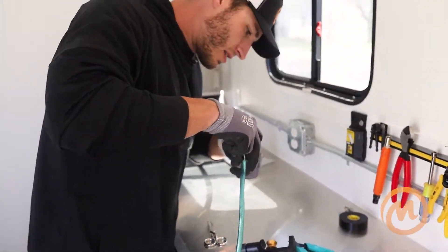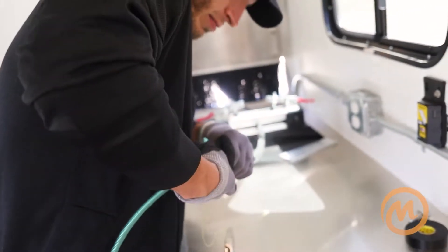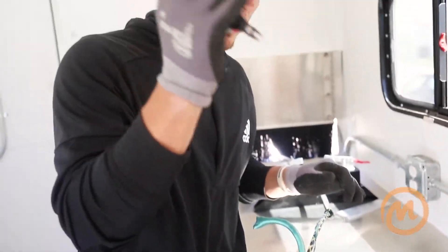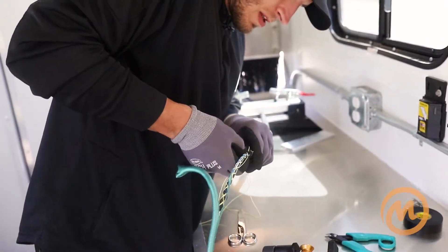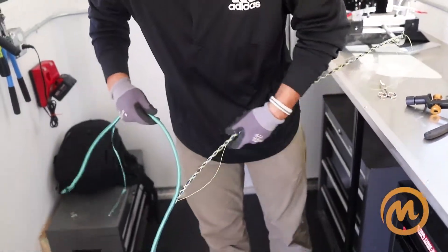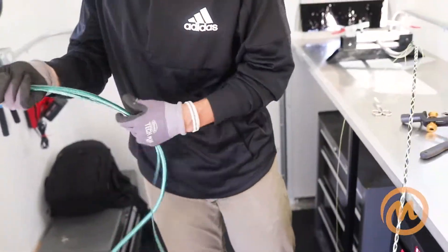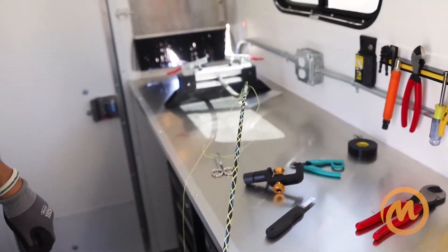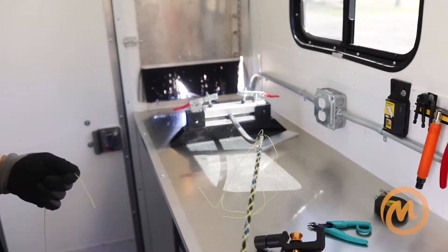Come to the base and pry up the armor just a little. That one kind of broke, so that's good, but it's always good to have flush cuts with you — give it a little snip. Just pull out your fiber. As you can see, we have that extra rip cord here — just cut it just like we did the other one.